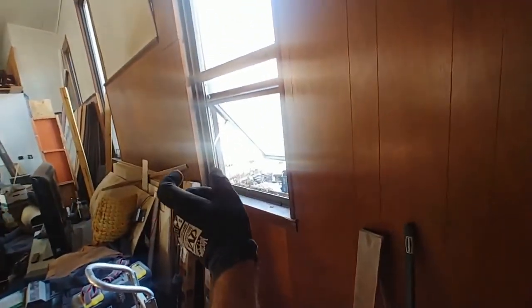You know, but when you do that, you've got to add so much. You've got to add all that dimension to the trim of the windows. But honestly, if this was my building, that's exactly what I would do. Even if I was going to keep this paneling, I'd take that off. I'd take whatever you want to call this trim off. I'd frame this wall out completely. I'd insulate it. And I'd build extension jambs for these three windows.